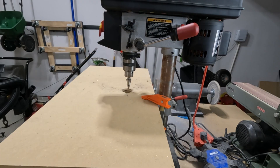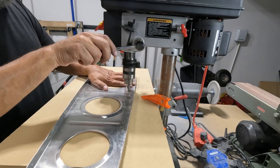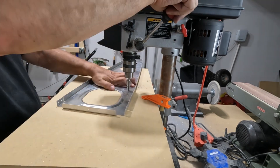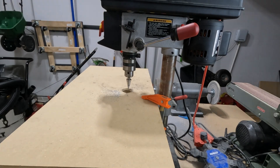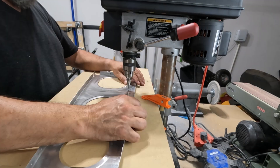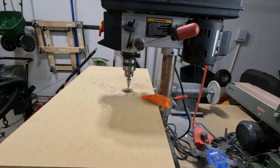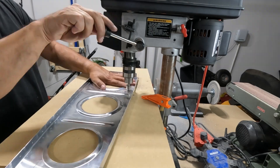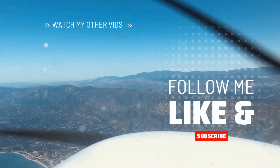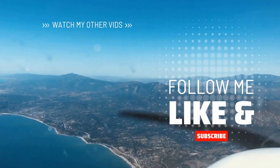More repetitive operations. Basically these are all three-quarter inch holes, which is the very last step on that unibit. I got all of those done and then grabbed a piece of 400-grit sandpaper to clean up the edge and finished that with Scotch-Brite. Those are all done and ready to go, and that pretty much wraps up this day of building. I said I was going to do chores, but ended up working about five or six hours. It's done now — thanks for checking it out. I'll see you next time.